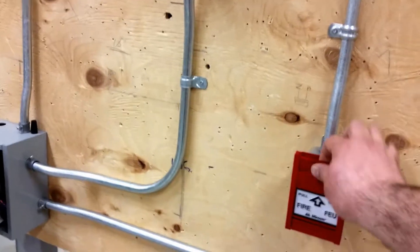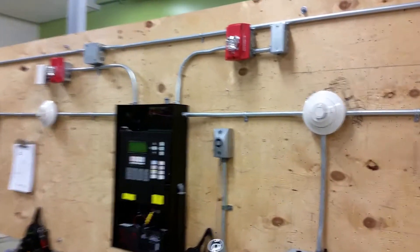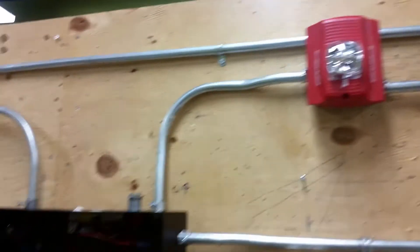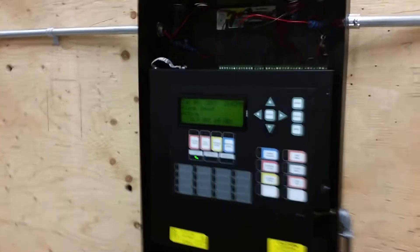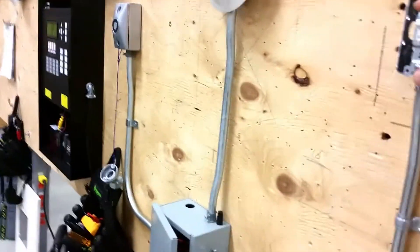Just pull this down — there we go. Our fire alarm panel is signaling the entire installation that there is a fire going on. Strobes are flashing, fire alarm says fire, and at the same time the mag lock fell down. Now if John again wants to put that on, I'm just going to show that no matter what this disconnect switch does, it's not going to hold.